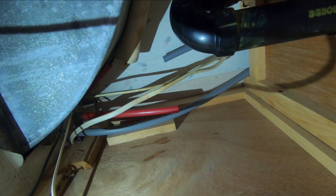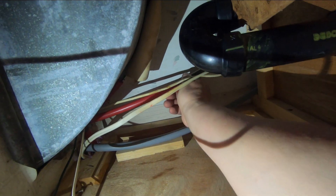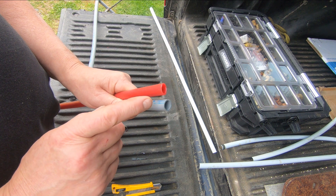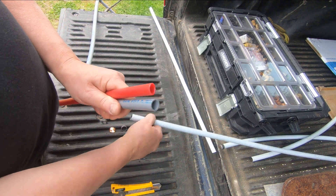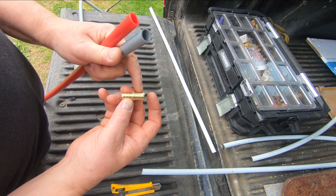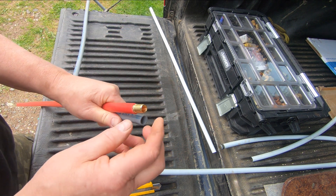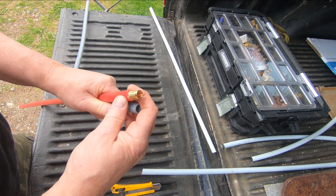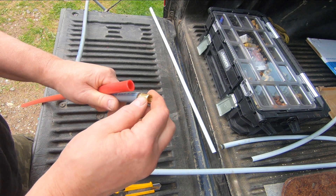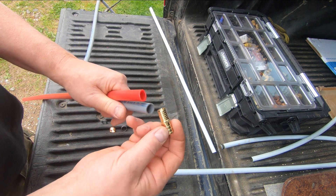Back to our main job. There's the PEX and there's the poly B. PEX can be a different color but it's the design, not the color, that's important. Here's that fitting — you can see the side that goes into the poly B is a larger size than what goes into the PEX. See, it goes into the PEX here and that's snug enough to put a crimp on. But see how loose it is in the poly B? If you tried to use standard PEX fittings to join poly B and crimp it, it's going to leak and could disconnect from the fitting.